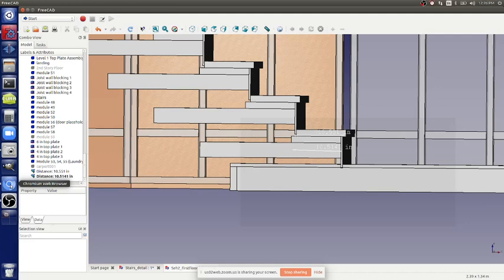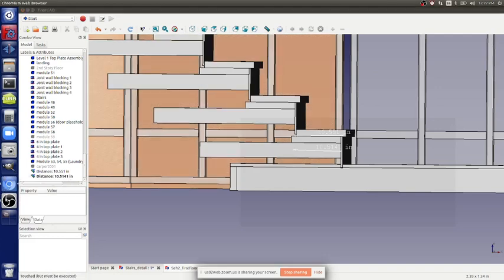And then 7.75 times 14, we're doing that 14 times, plus the first step, which is 7.5. Does that give us the exact height from the floor to the second? So let's write that down. Those are two critical verification points that will prevent us from having to mark everything twice. So let's just record that.